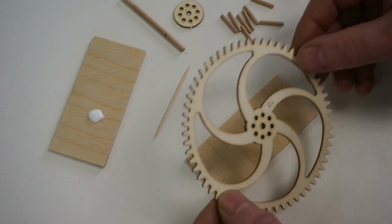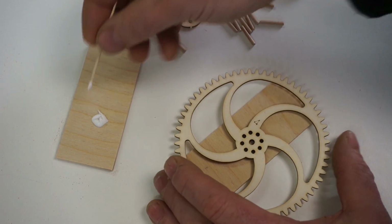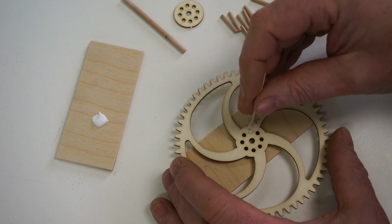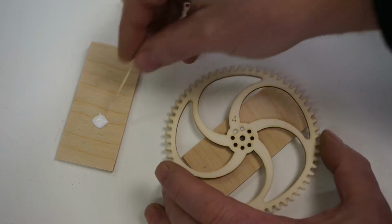This is the intermediate cog, and as you can see, I have already glued on the strengthener. I used normal white glue to stick the pins in. Do not be too sparse with the glue, as it is this pin to cardboard joint that gives the hole its stability.